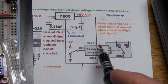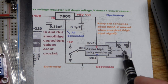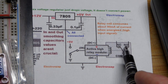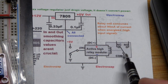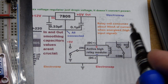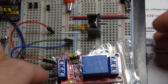When you bump the input up to the positive supply, current flows and the coil will energize. Current will go through the coil and it will push the switch to the normally open position. While the coil is energized — that's not the normal state — it will make a connection there. So if we have a load there, it will be powered at that time. If we remove energy from the coil, it moves back to the normally closed position, and a load there would be powered instead. The load can be completely separate from everything else, but since I'm thinking of loads around 12 volts, it will actually share the power from the positive supply.